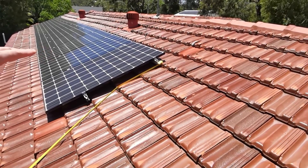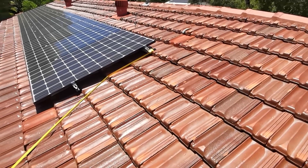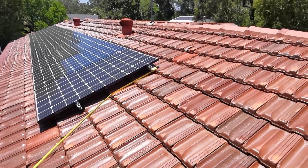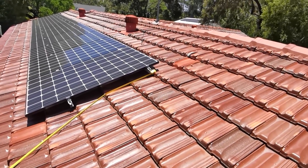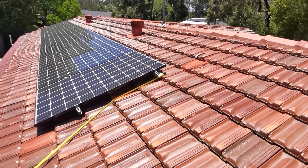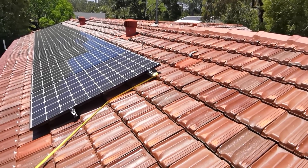You can mix the 250 watt panels — I could have 4 x 250 watts and just buy the extra 4 x 380 watts. Let me know which of those 3 options you'd choose. For symmetry's sake, 5kW seems like a nice round number, so I'm more inclined to replace 4 of these panels with 380 watt ones, then I'd have 2 separate strings — one for the 380 watts and one for the 250 watts.